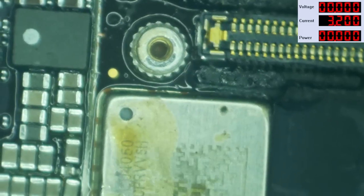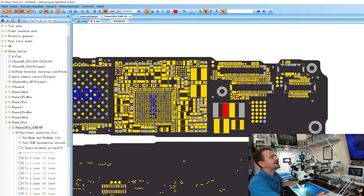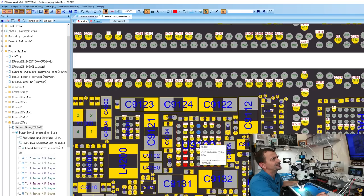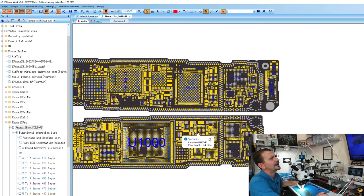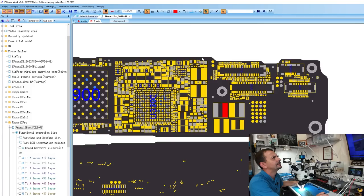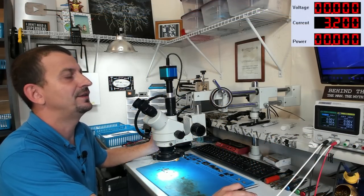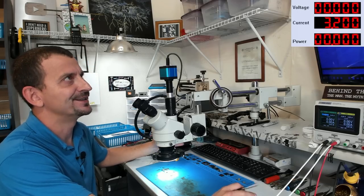That shield is a little bit smashed, but also looking back over at the board view, the opposite side of the board from where that heat signature is, is actually where we have this display. Yeah, that is exactly where it's at, right? If we flip the board, it's pretty stinking close, isn't it? So I think we're most likely not going to find anything under this other shield that wasn't removed. It's probably what the last guy thought too before it got sent here.